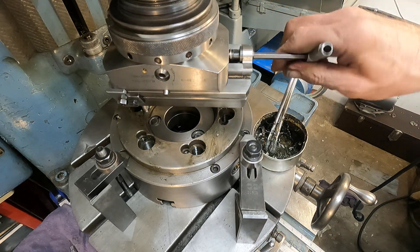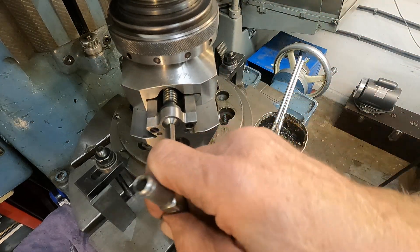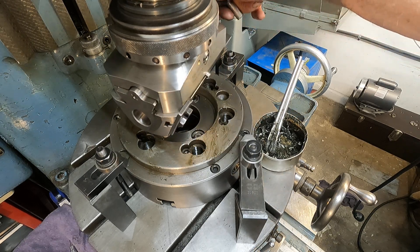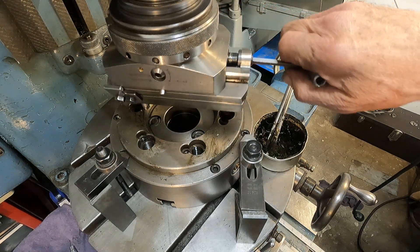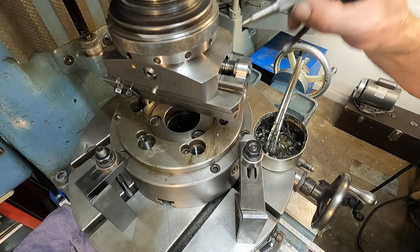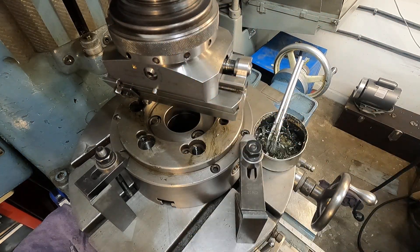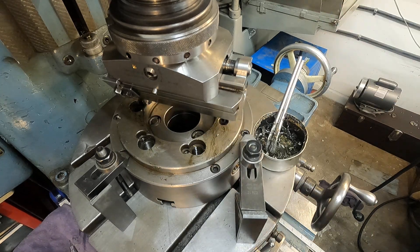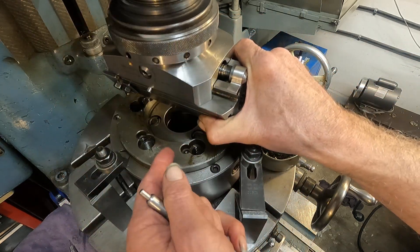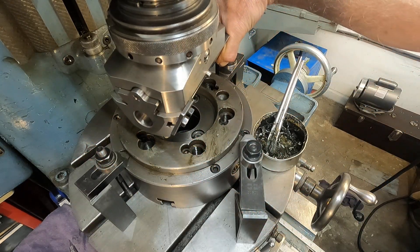I can position this thing like this. And for the feed, I'm going to give it a 1½ thousandths feed. I've got this pin pushed in here, and I believe I've got a pin back here too. So each pin is half a thousandth. I spread it around the ring there, and right here is a star wheel that catches those pins and clicks over. This is like ancient stuff, but it's in a modern package and it looks great.